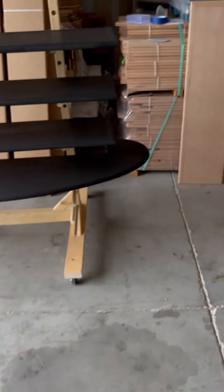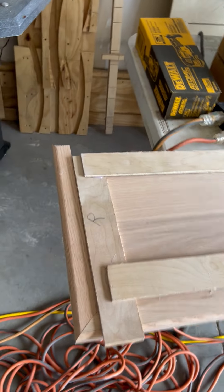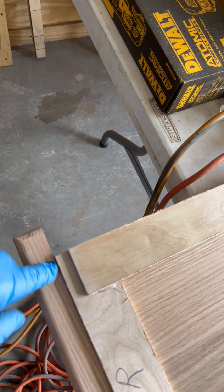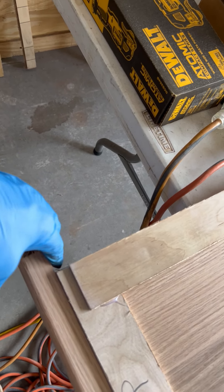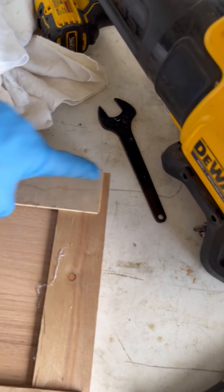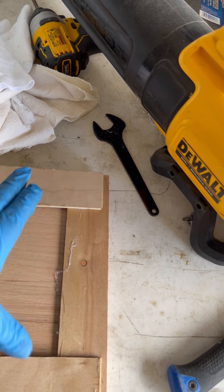I just fabricated it. Here's one that's done — kind of the process on that. You got an open side step — got a little bit of everything on this one. This has got a return. Basically the way I got it set up is when I hold it against the back there, I know that my return is going to be right there, because this is going to sit against the wall on this side. Or if there's a skirt, you'd be running this against the skirt. Once I get it lined up, all I gotta do is just make a line here. If this were a pie shape and it were curved, I'd do the same method where I just cut the Luan into pieces, curve them, and then hot glue them in.